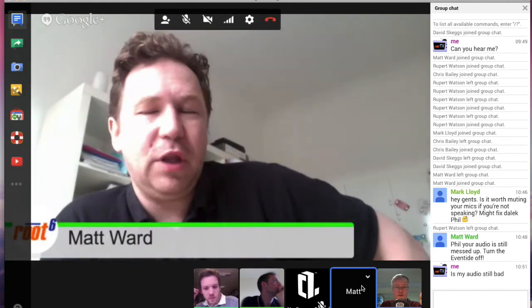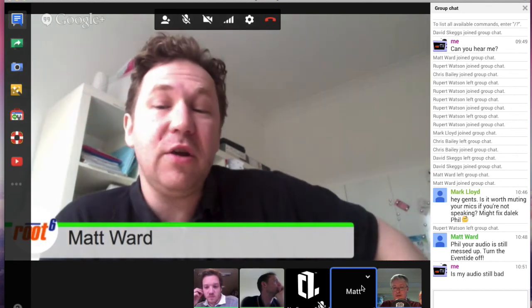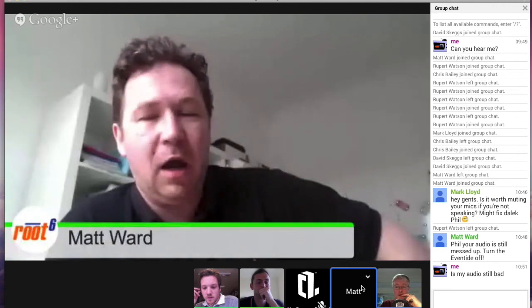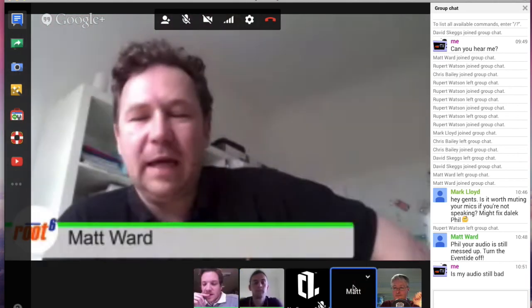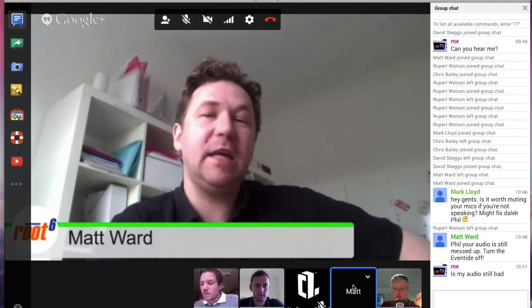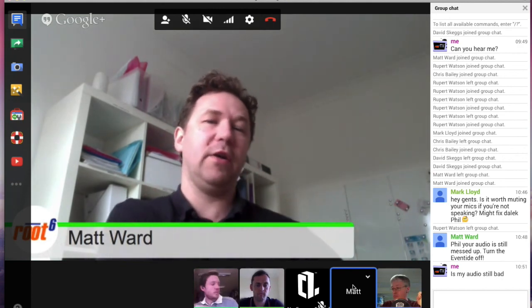That's interesting. But the only thing you lose with bigger block sizes, when running audio on it, is capacity. Everything takes up more space. But you don't really lose the speed. It's interesting. I don't know about the LUNs thing. I'd like to find out more. Yeah, he was a bit coy about going into that further. But it's all about seek time, as I understand it, for audio, because you're looking for a continuous stream. You can't just transfer a chunk of data, wait, transfer a chunk of data.